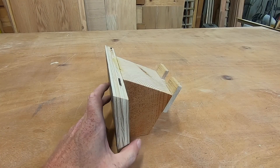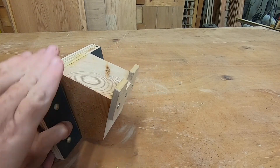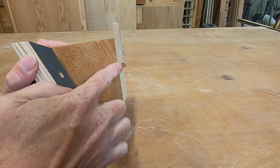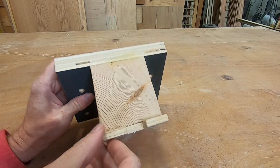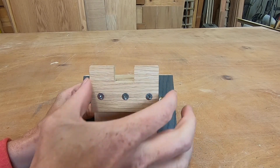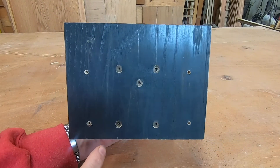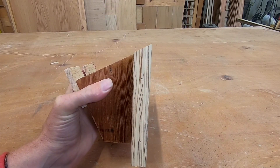So this is what I ended up with. I cut this at 20 degrees, which I measured from the pedal, and then because the pedal and the crank are 90 degrees to each other, I had to cut that to make it 90 to this angle — this angle is 90 to that angle. Then I got some oak, not very thick, glued and screwed that on there for the pedal clip. And then countersunk some holes on a piece of plywood which I glued and screwed through the back, through those holes.